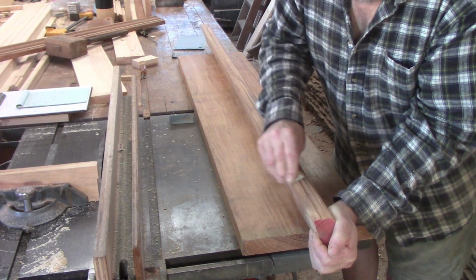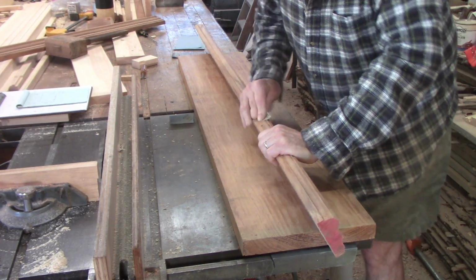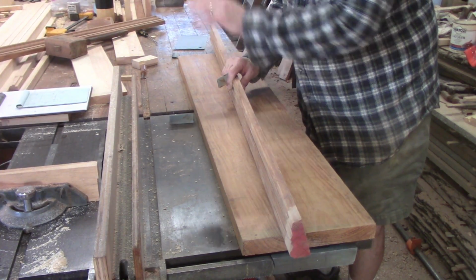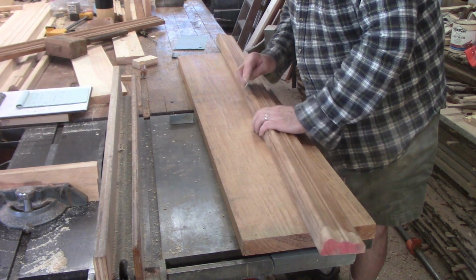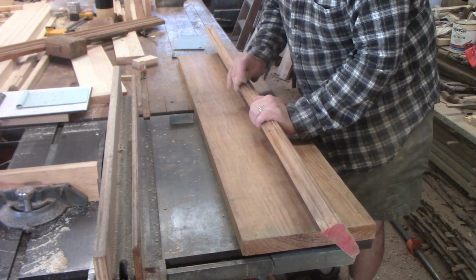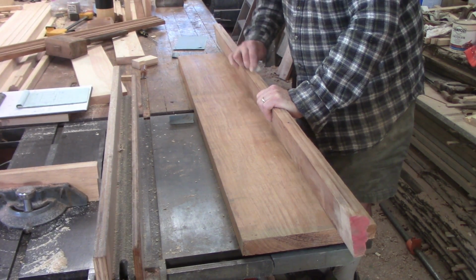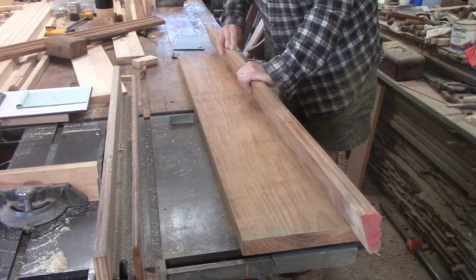Now, I'm going to have to put a rabbet in this for the glass and the actual picture and matting. I haven't done it yet. That rabbet's going to go down here. The table saw is kind of tied up in the middle of an operation, can't move it at the moment. Hopefully tomorrow. I haven't touched that, but maybe I'll splash some shellac into the rabbet at some point, but the rabbet pretty much doesn't matter. It's going to get stuffed with glass and matting.